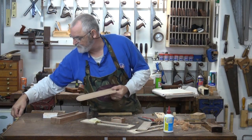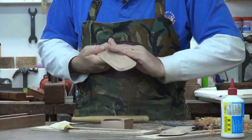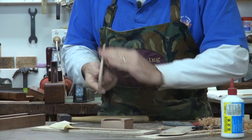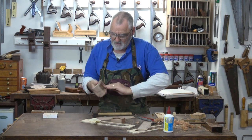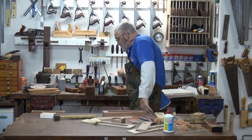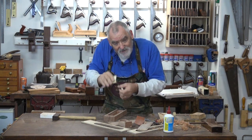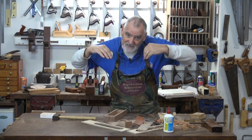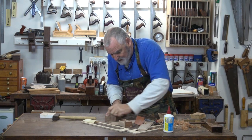With a bit of 320, just go over the entire piece now, just taking any sharp edges that may be there. On the nose, over the top, so we've got nice flowing lines, and the same here — just take any sharp angles that might be there. Get rid of any pencil marks, and remember: if you're removing pencil marks, always use an eraser. Because if you try and get them off using sandpaper, you're abrading the timber to get rid of the graphite but you're actually pushing the pencil deeper into the grain. So then you've got to rub hard and you end up getting hollows. Whereas if you use a pencil eraser, it takes it off and your surface remains nice and flat.